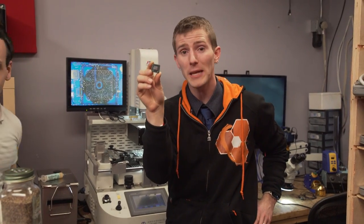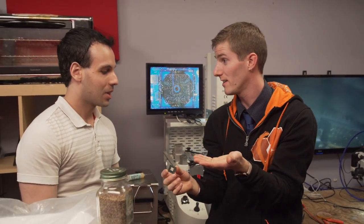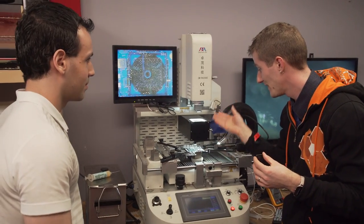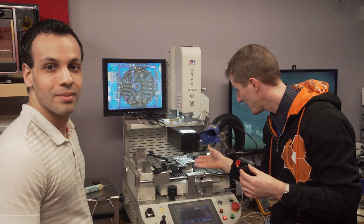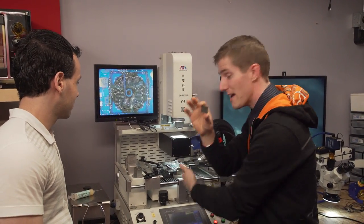So this right here is a PCH that was sourced from somewhere, because you can't actually buy this stuff directly from the manufacturer. That's one of your frustrations, right? Incredible. So maybe it works, maybe it doesn't. And then behind me, we've got a PCB from a mainboard that was literally thrown and had its PCH pop off. So without knowing if that works, and without knowing if this works, we are going to resolder this BGA chip onto that PCB. I'm going to do it, and it is not going to involve an oven, and it is hopefully going to work, but if it doesn't, then... That would be pretty fun. Yeah. It'll be fun either way.